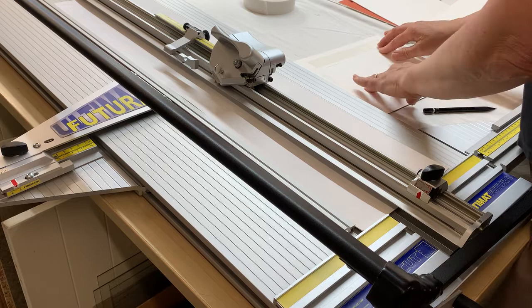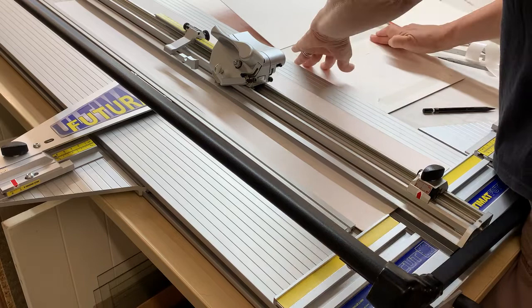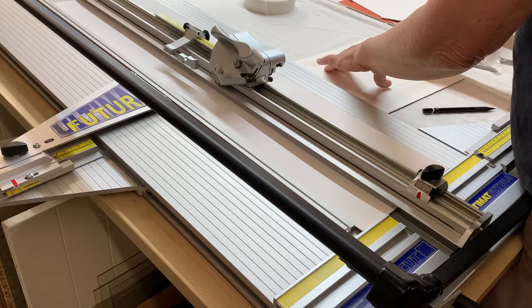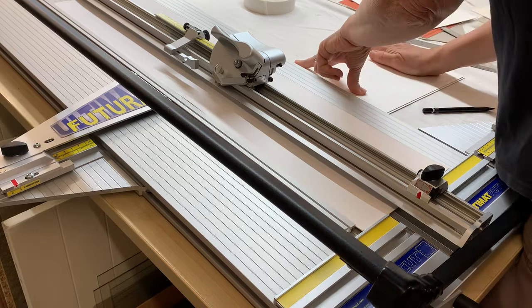So line them all up beautifully, ensure that the orange board is aligned — use finger lift double-sided tape, it's very handy, you just lift that off, make sure it's all stuck down properly and then finger lift it off. Very handy and convenient. I actually use both interchangeably depending on what I'm doing. Board's nice and flat, nothing proud. It's very important that this top mount is accurately cut and everything's accurate, otherwise the lines might not be parallel.